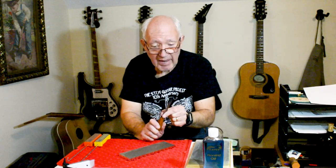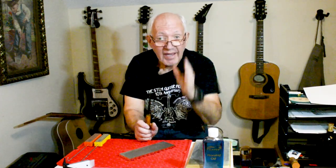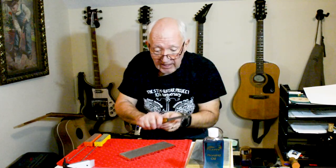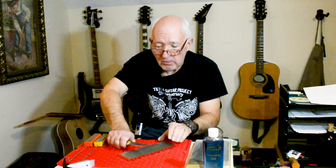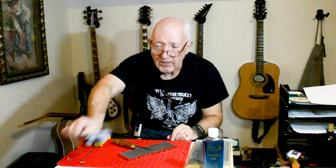The mission is clear: turn this flattened apex — a very long narrow rectangle — into a long, very narrow straight line at a given fixed angle. The challenge is that many people, myself included, have a hard time keeping the angle exactly the same from stroke to stroke. If the angle changes, you end up with a rounded apex. So what I do to keep the angle consistent is use a sharpening jig. Let's set up and start the sharpening process.